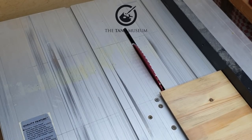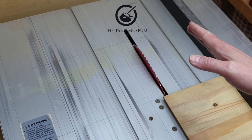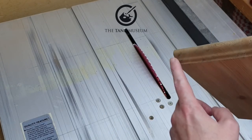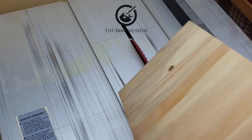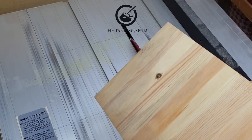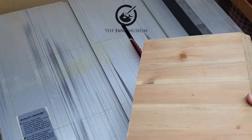Hashtag sponsor me. So what I've done is I've tilted the blade to a 15 degree angle, and I'm just going to nip off this edge here, and then as I mentioned before, I'm going to put a 15 degree bevel on all four sides, and then we can give it a little bit of a sand just to tidy it up a bit.